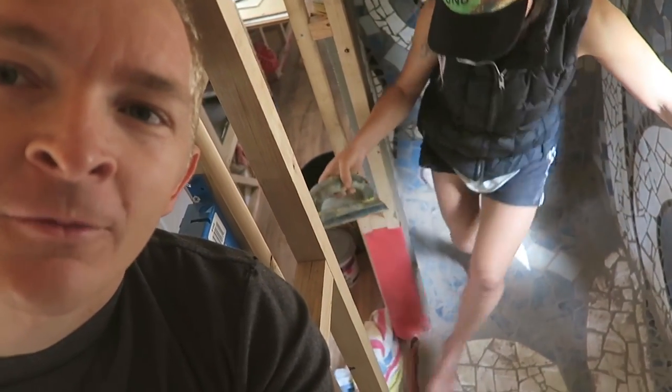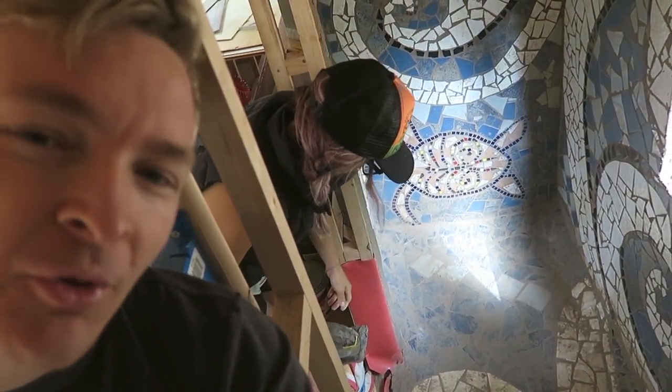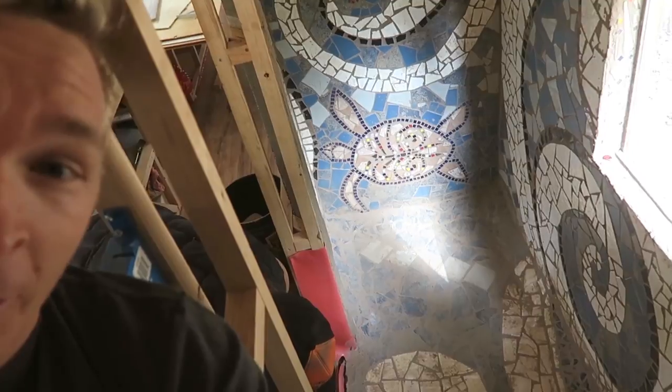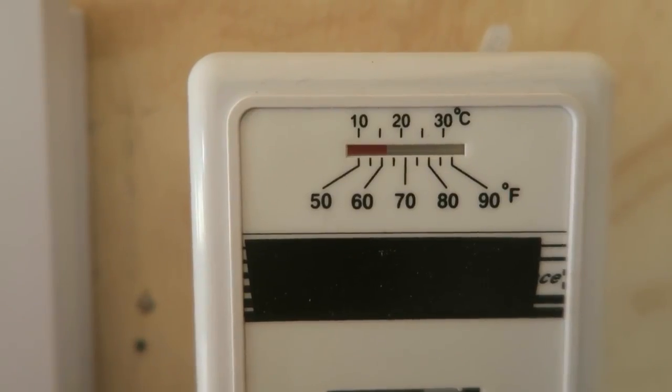Now that the floor is all grouted in, we just — well, it's actually kind of chilly today, so the box tells us it requires an hour after application to come back and wash it out. When it was really hot up here, it only took like 20 minutes before it was so dry that we were racing to get it off, but today is going to be a bit slower. It's like 63 degrees outside right now — we went from 100 to 63, that's a serious difference.